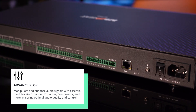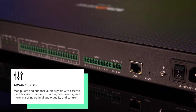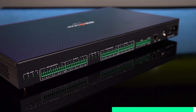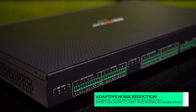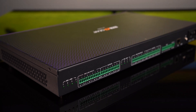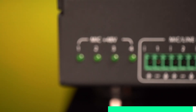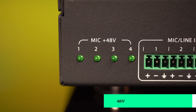Let's get into some of the more specifics regarding this model, so you know exactly what you're getting with this product. First of all, you're going to get an advanced DSP already on the unit. You get quality audio conversion — that's going to be active high-quality audio output at 48 kilohertz sampling rate and 24-bit AD/DA conversion. You also get echo cancellation as well as adaptive feedback in order to mitigate feedback problems and improve the audio performance.